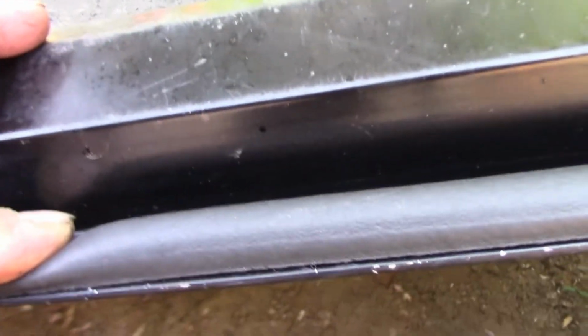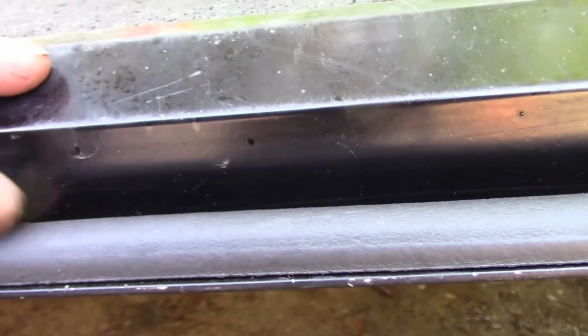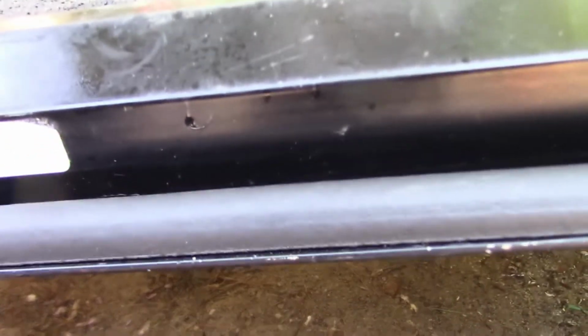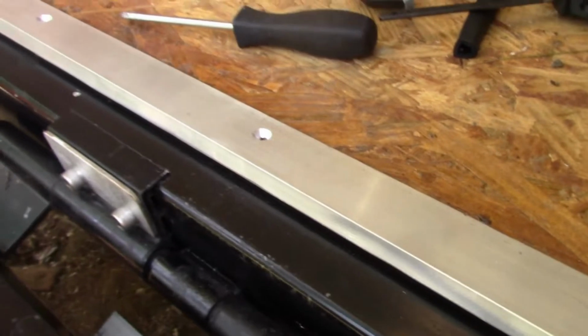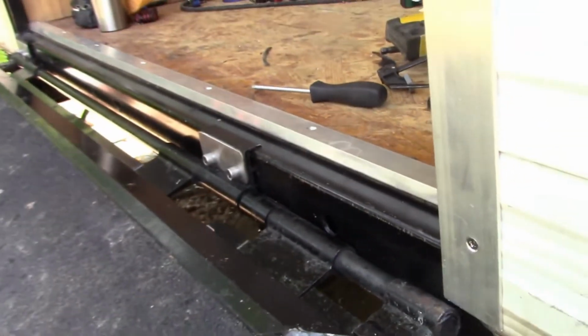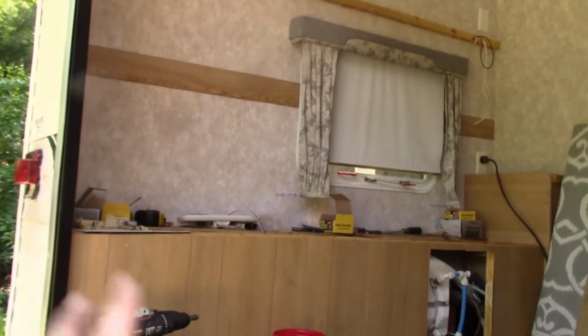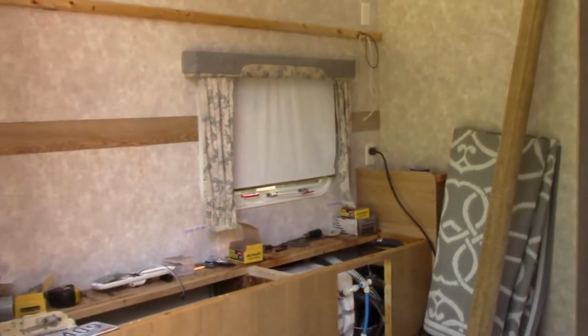When you adjust the door, the gasketing compresses down to as little as 1/8 of an inch. So I'm pulling this down from probably 1/2 inch to about 3/16. So I've got a real nice seal compression on there. The door's all adjusted with the latches, so this part is ready to rock and roll. I made myself a threshold here that'll trap the flooring, which you'll see in a little while. First I'm going to get all of the fabrication, or woodworking, done for the bed and the hinge mechanism so it folds up to allow the motorcycle in the back of the trailer. I need to get going on that, because we need to get going on vacation.